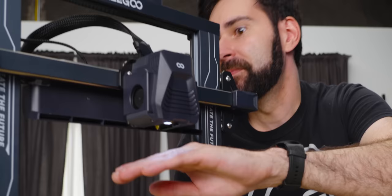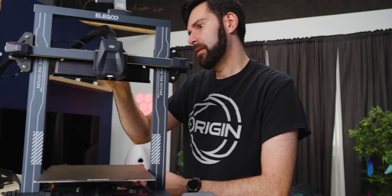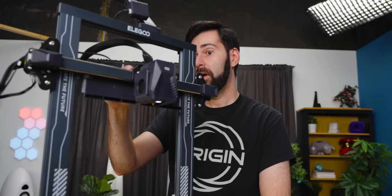She blows! I think I'm a little disappointed at first because the fans at the back... but the layer fan is now one single control, which simplifies a lot of the G-code things. So you're not managing two types of layer fans — the on/off switch connects the two layer fans together, so you can either have both of them or manually turn off one of them, which is better than the alternative I thought it was. It's whisper quiet — for how beefy all of these fans are, I expected them to move a bit more air.